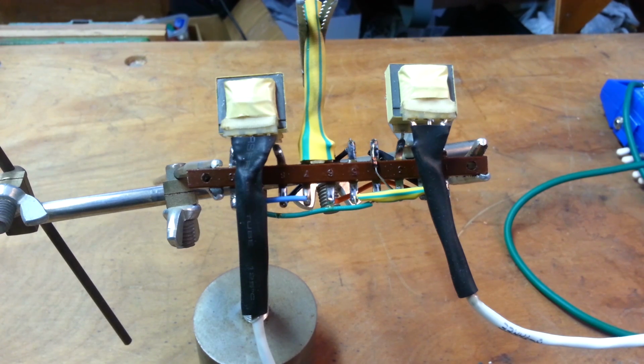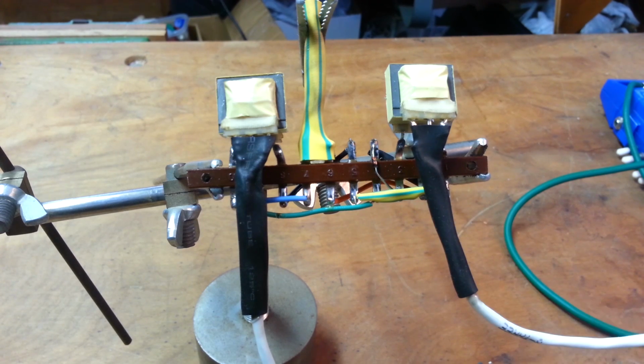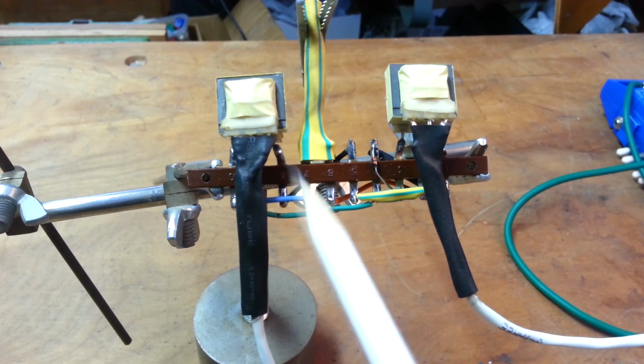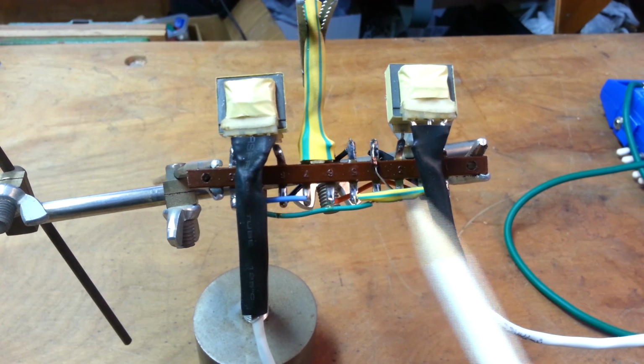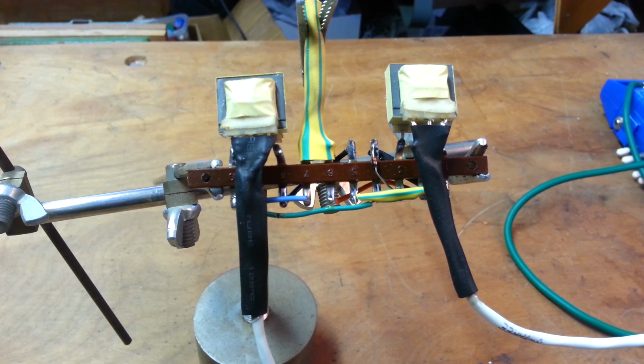The way that Ben described this ring mod circuit to me as its build style is dead bug on solder strips. So if we look here, we can see that each of these numbered bars, or solder lugs, passes through the bar, and he's got all the different Zener diodes and such just soldered where they need to go in the circuit. I think this is an interesting style for sketching up a circuit or just generating one quickly without the use of a printed PCB.